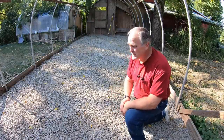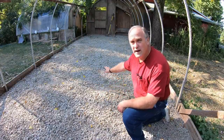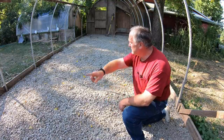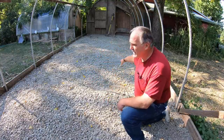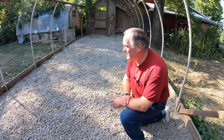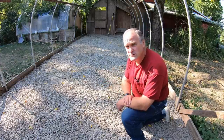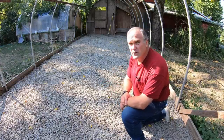This is as far as we got with the chicken house. I still need to run the plate compactor over the stone to compact it down, put in screed boards along both sides so we can screed the concrete to a level when the concrete truck comes, and put in welded wire mesh to reinforce the slab — all this before the concrete truck can show up to pour.